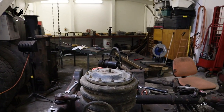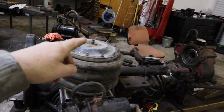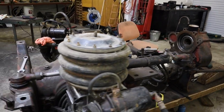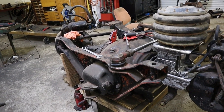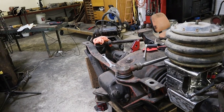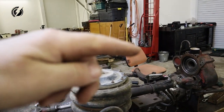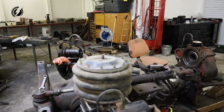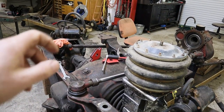The next step would be to add the top bracket for the suspension, attach it to the airbag over here, and anchor it into this point and into this point. But when you take a look at that, if I do so, there will be no room to put the front bumper. So actually I need to put the bumper first there, then I would attach the bracket on the top of the bumper, go over the airbag and attach it here. In that case, it would be better if I first duplicate the bottom bracket for the other side. Let's go!